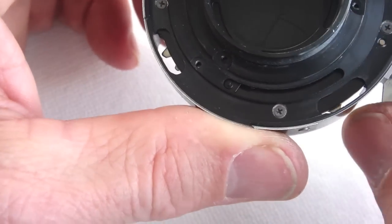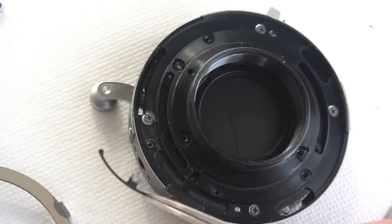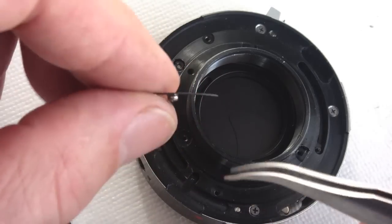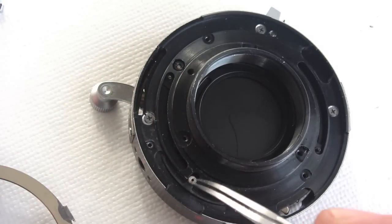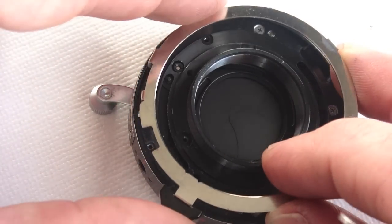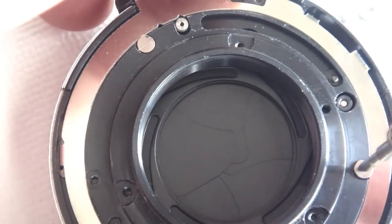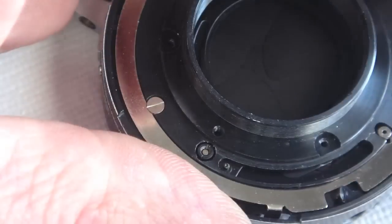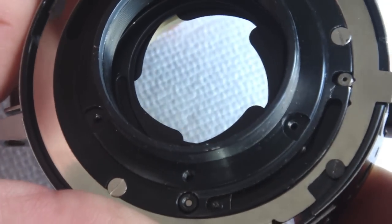Give it a quick test. Install the detent bar — it goes upside down and backwards, but there, that looks about right. Now install the shutter ring, making note of the detent points. Make sure that the proper screws are installed to hold the ring in place. Note that the screw that goes in the notch has a shoulder on it. Test to see that it functions as it should, locking the blades open.